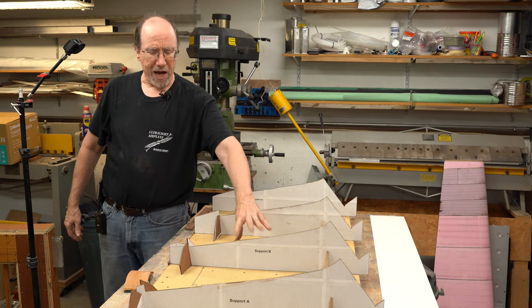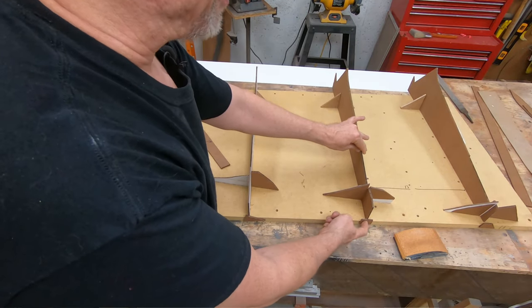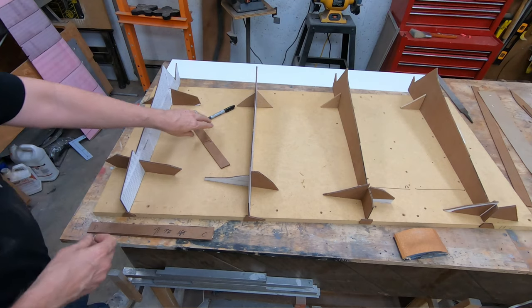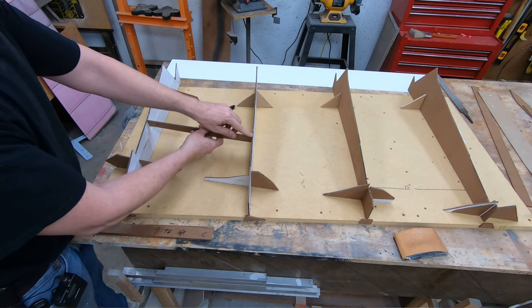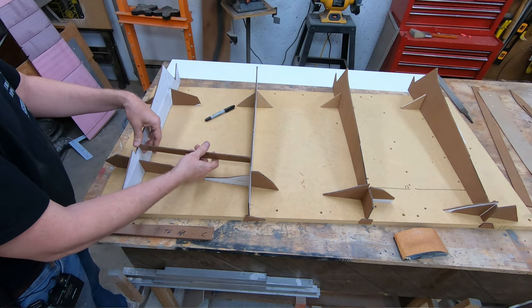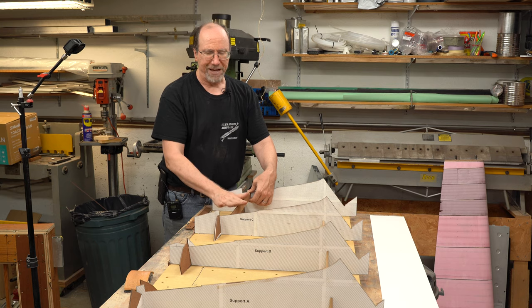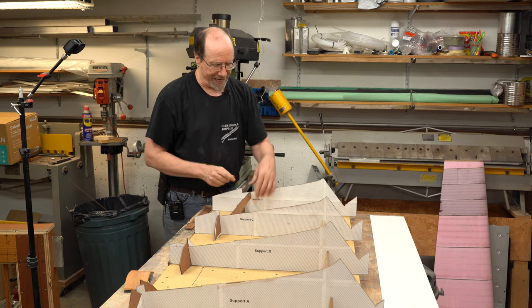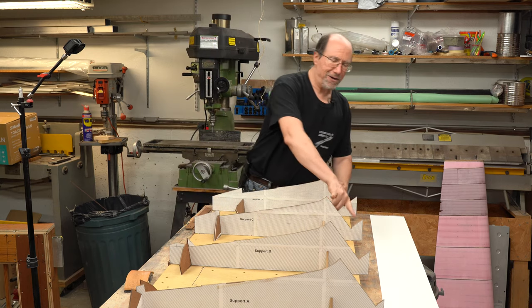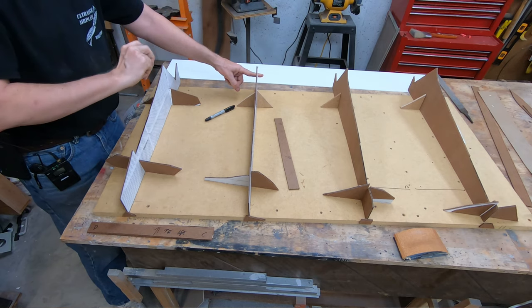My next step was to hot glue these ribs in place, making sure they were back against the little stops I'd already hot glued in, so they'd be keyed and registered in the right spot. Once done, I'd start putting stringers in. One stringer would be about an inch back from the front edge where the plastic strip would be, and another further back where I'd be putting pressure while applying epoxy to the fiberglass. I'd do that all along the back edge and on the ends to help support the plug extensions, and the same thing on the front.